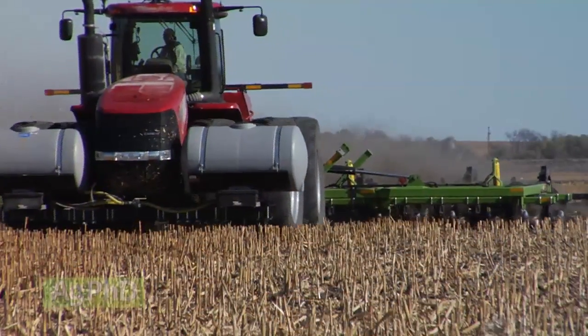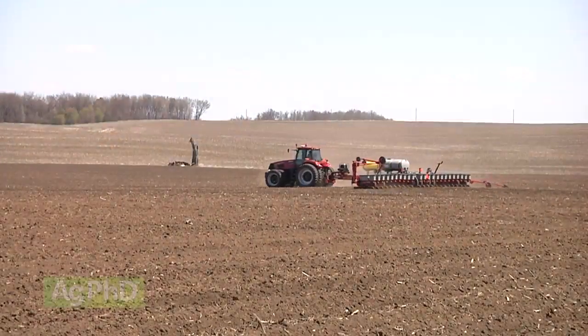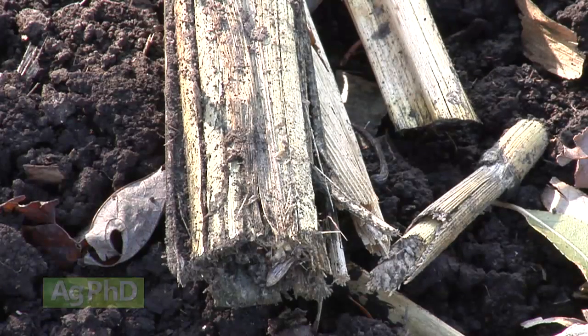We like leaving a little more residue on top, but we need that residue to break down eventually. We don't want a thick mat of residue that won't allow our next crop to get up. So by doing this vertical tillage with the coulters, we can chop up pieces of residue, move them around, and get them out of the way — like with a row cleaner on our planter — so we can have a nice clean strip where our crop can emerge. We can also stir some soil onto that residue; soil contains bacteria that can help break down residue more quickly.